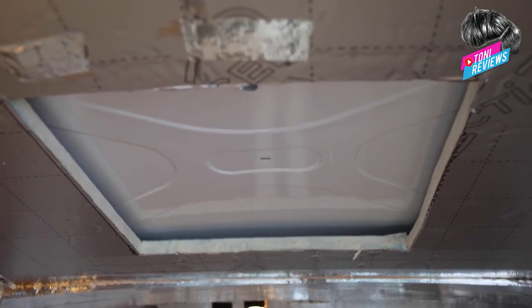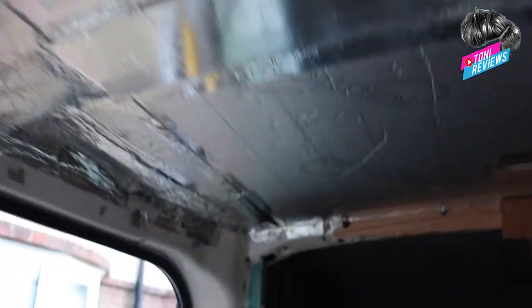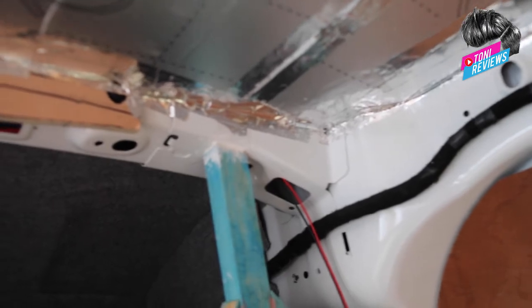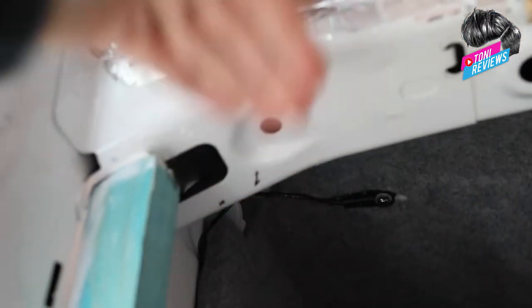This is the hole I've cut in the insulation board where the skylight's going to go. The front panel goes from 160 centimeters wide across the van but it tapers in towards the front down to roughly 140 centimeters. And it's not only tapered — you're working on two axes. When you're cutting the wood, you're not only cutting it one way but also tapering the other way, so you've got to cut weird compound angles. Everything has to be cut bespoke to fit these angles.